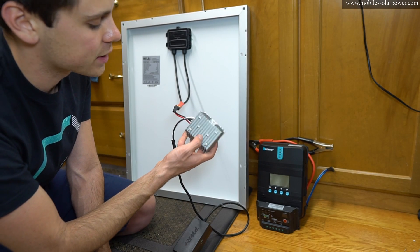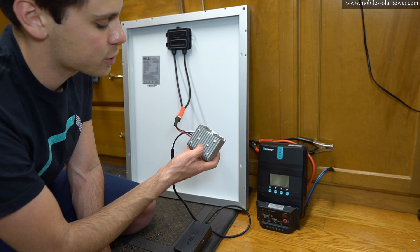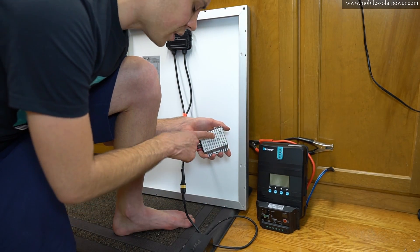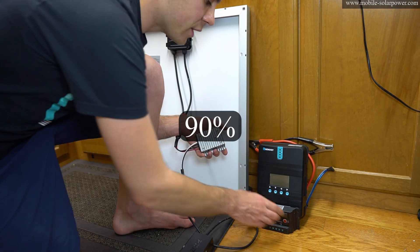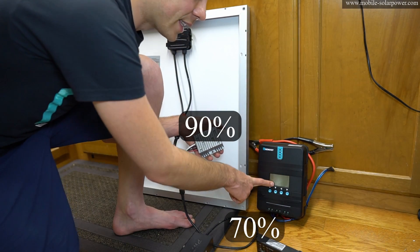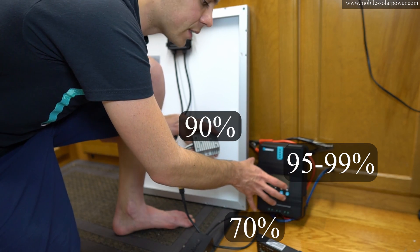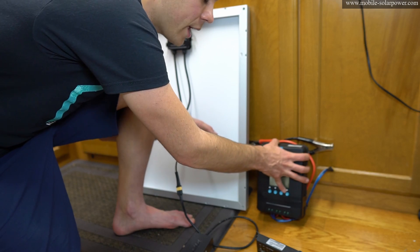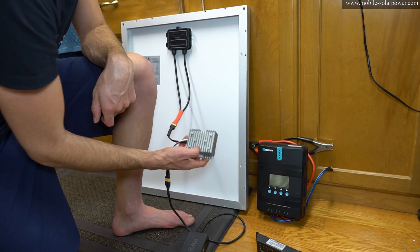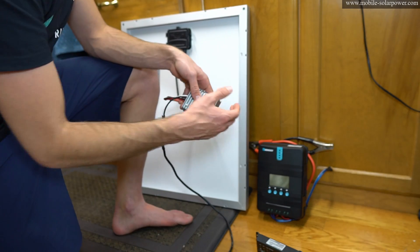This also has lots of safety protection features: short circuit protection, over temperature protection, and lots of cool stuff inside. We can also talk about conversion efficiency — this converter is 90% efficient, this one is only 70% efficient, and this one is 95 to 98.5% — some are 99.7% in ideal circumstances. For a micro mobile system, this converter works really well for charging things on the go directly from a solar panel.